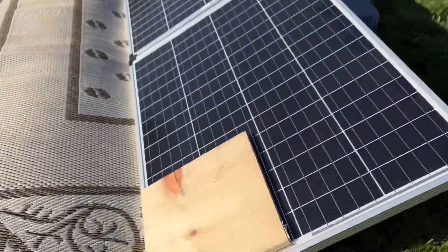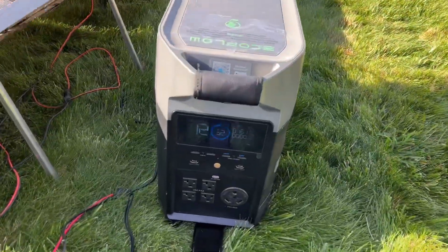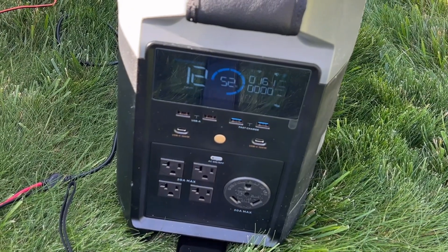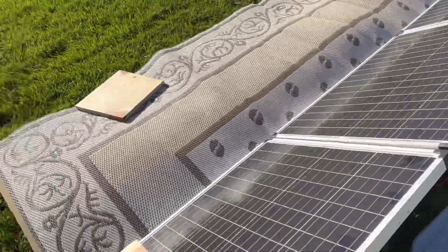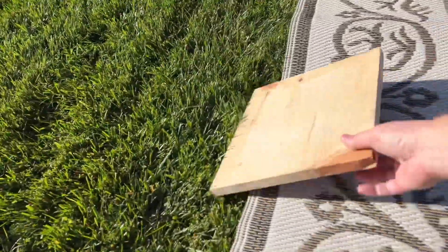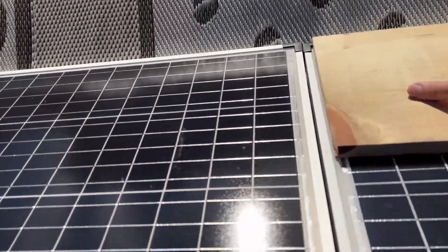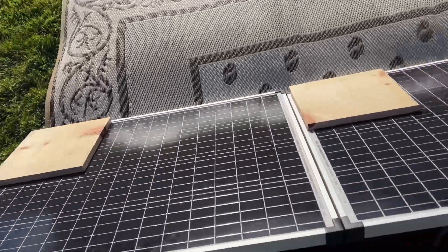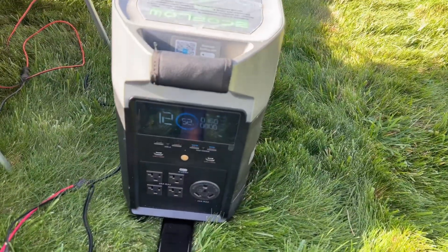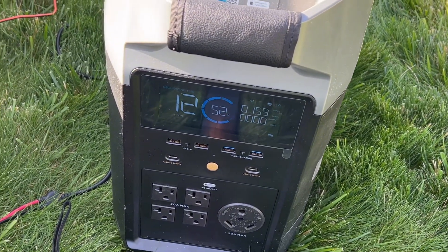Back to testing the series-parallel connection. I'll put this block on one solar panel. We were at 315 watts — now those two panels are at 100% output but these two panels are basically dead. I'll cover this one and that other one so those two are basically zero output. We're still getting 160 watts from the two unaffected panels, about 80 watts each.